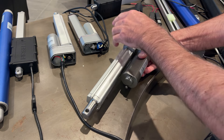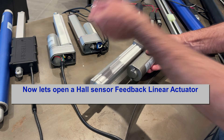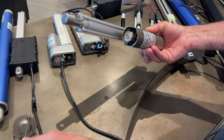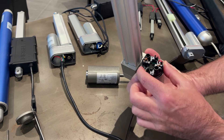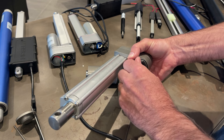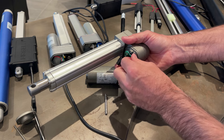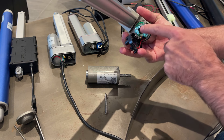We've already shown two feedback actuators - the potentiometer style and the optical sensor style. These super duty actuators have hall sensors built in. Hall sensors work on a magnetic type of system. On the motor here, we'll unscrew this so you can see exactly where the hall sensor sits. That is the hall sensor PCB, and you can see the magnetic sensor.